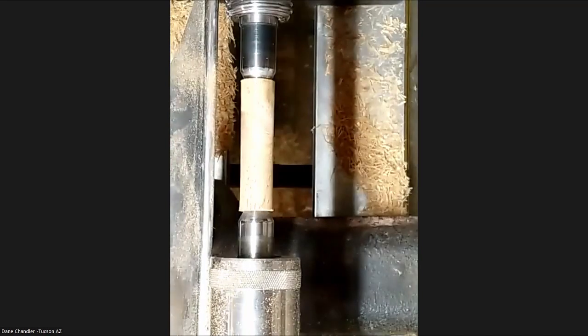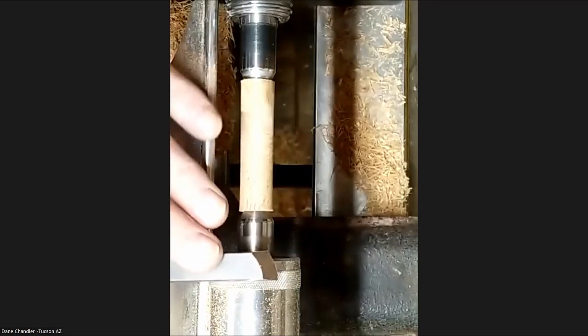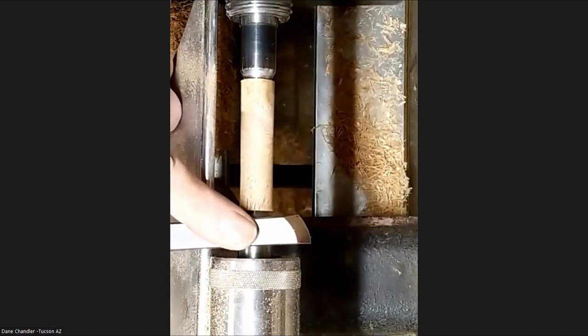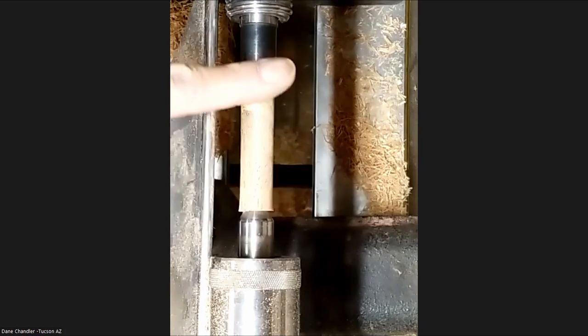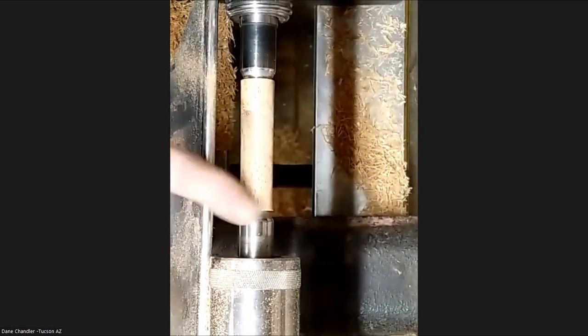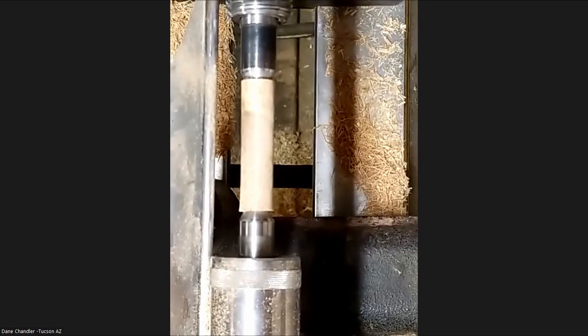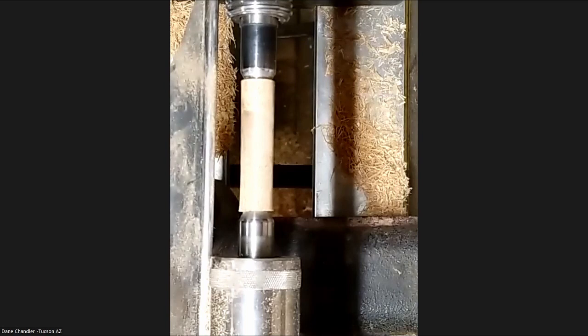And then also with the force, when you're using a mandrel and you got your 2 pen blanks on there, or even 1 pen blank on there, you got another apparatus that is going to experience flex as you're milling your blank and cutting it. And doing it between centers takes any of that flex away, and it prevents you from having any inaccuracies on the side of the barrel blank. To include those that use the mandrel saver with a mandrel, you're going to have some degree of flex in there when you're cutting. So that's where we're at on that.